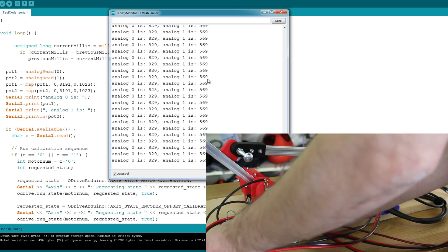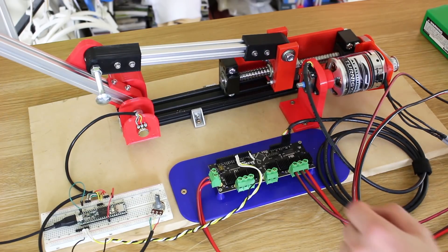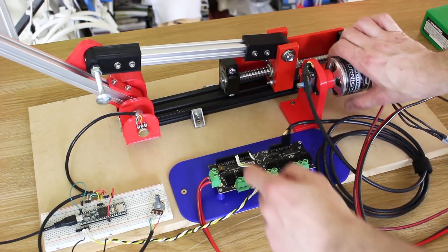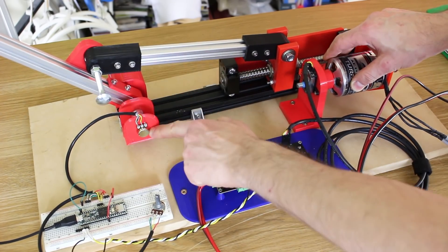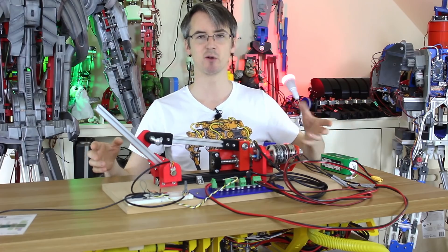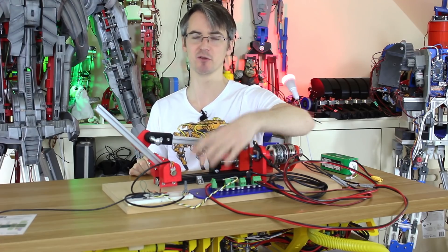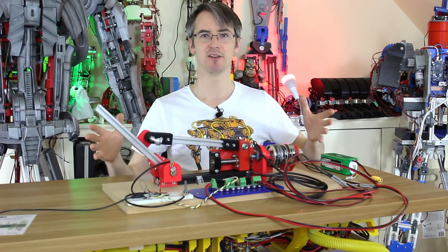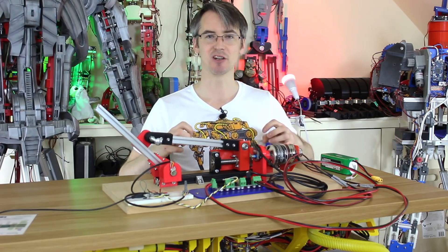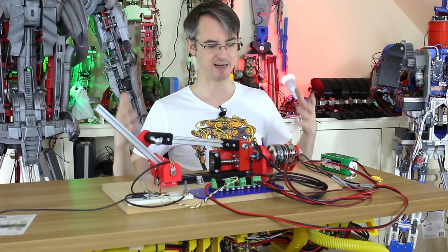Obviously we've still got this wire running right past the actual pot itself with its unshielded body, so that's a pretty good test. You should only be looking in the second column, because that's the pot with the wire wrapped round. The one attached to the joint will vary more as I'm moving the motor. Now, people might shout that all I've done is remove resolution — which is true — but it does give me an almost rock-solid number. If I had a more expensive pot and shielded the body, perhaps we could get a really solid number that never changes. That's quite useful because if we're going to use that number to drive a PID controller — which is essentially an amplifier — any jitter will get amplified. If there's no jitter and the number's rock solid, the output of the PID controller will be solid, the motor won't jitter, and there'll be no knock-on consequences.